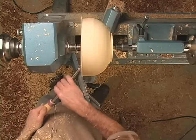That looks pretty good. Now, I want to give you an argument for having a lathe that reverses. You'll do a much better job power sanding if you can get a lathe that reverses. So basically, if I'm going 80 grit in one direction, I go 120 in another direction, 180 in the other direction, 220, and you'll get a much nicer sanding job.